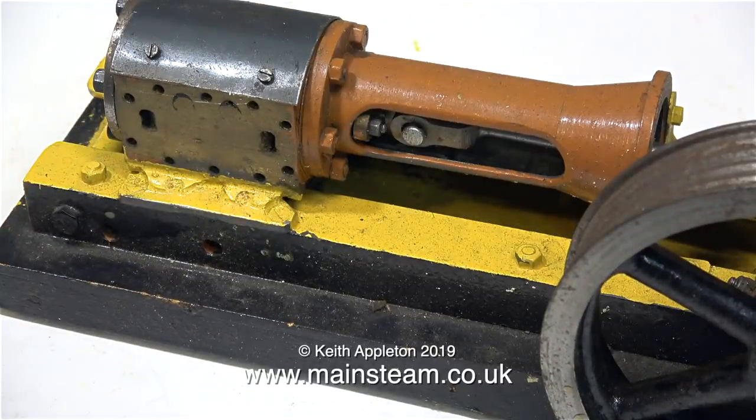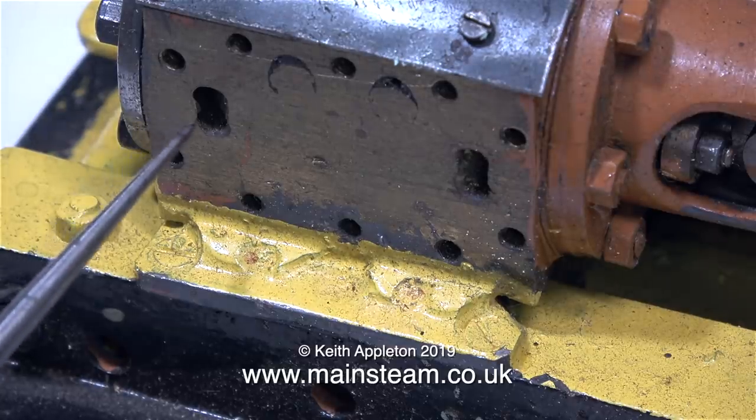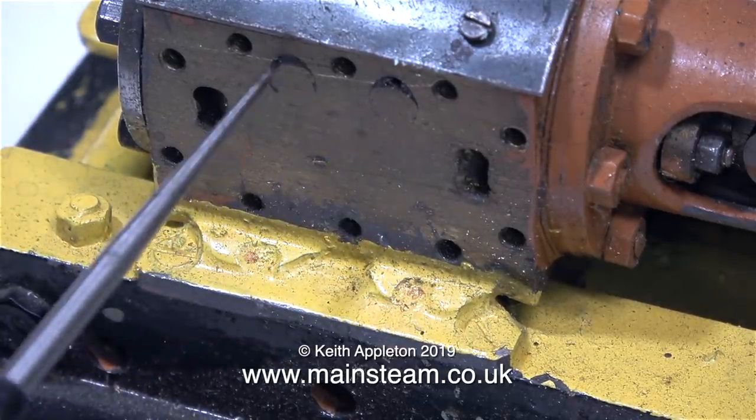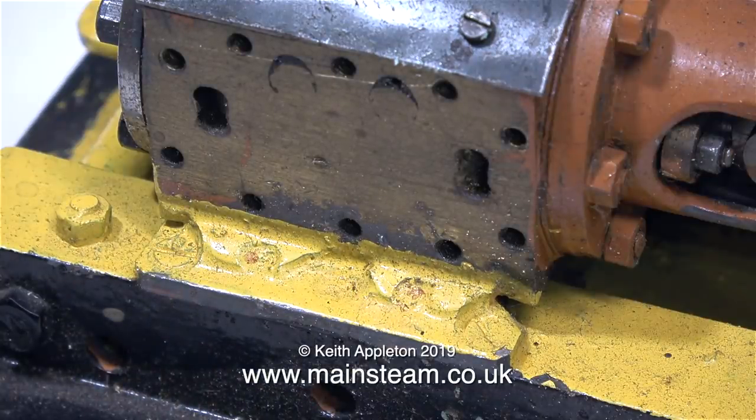But the main thing is, where's the steam chest? Why is the steam chest not attached to the engine? Whenever I see models where the bolts that hold the cylinder cladding on are not in line and roughly fitted, it's usually the tip of the iceberg — and it's very true with this engine, which is also a bar stock engine. The flywheel is cast, but that's about it. The other problem is this is designed to use a piston valve block, and in my humble opinion the engine is too rough, not very well made, and the missing part could be difficult to manufacture for a beginner.